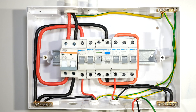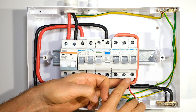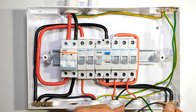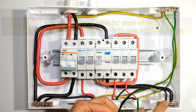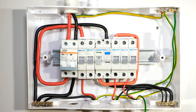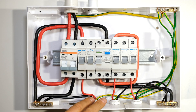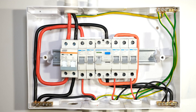For explanation purposes I'm going to connect one more load — a lighting circuit — on this 10 amp circuit breaker. The associated neutral for this lighting circuit must be connected to this second neutral rail because it is on this side of the earth leakage. The earth wire for the illumination circuit must also be connected to the common earth rail. Everything is now connected — apologies for the untidy wiring; we use flexible cable so we can reuse it in the lab, yours will be neater.